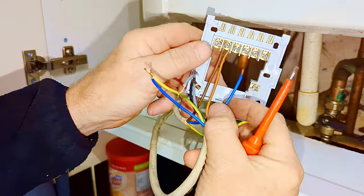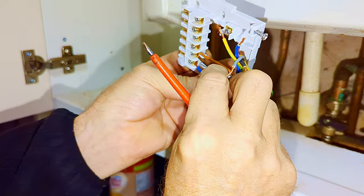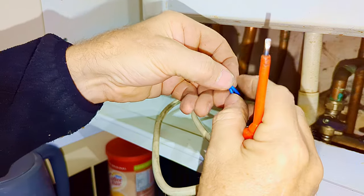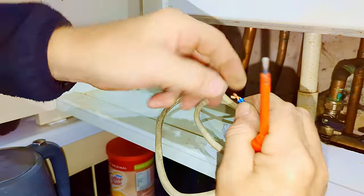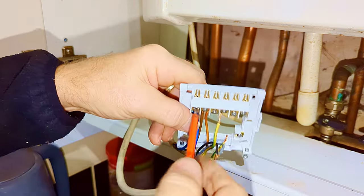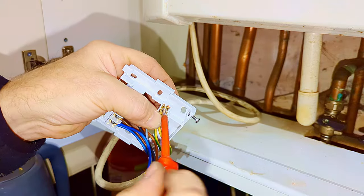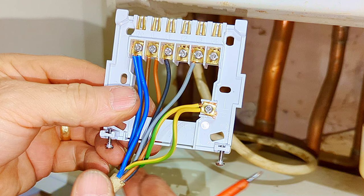After doing that, I just want to give the wires a little tug to make sure they are nice and secure and not going to be pulled out. I then continue with the rest of the wires until the plate is fully wired up. If you have got two wires going into the same terminal, sometimes it's much easier to just twist the two wires together first. And there we go — that's my neutral wires done. I then finish off with the earth wire. That's it: live coming in and live up to the boiler, neutral coming in and neutral to the boiler, switch wires on one and three, and earth to the boiler.